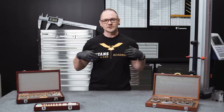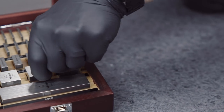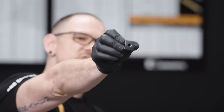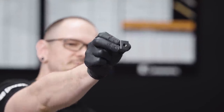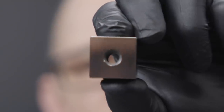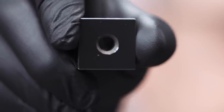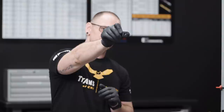So what is a gauge block? Gauge blocks are a fixed measurement length. They are composed of one extremely shiny, extremely flat surface, and another extremely shiny, extremely flat surface that is parallel with the other side. It also has a hole in the center that allows you to use a rod to put together very large stacks of gauge blocks.